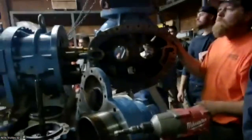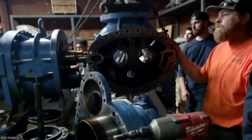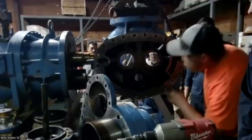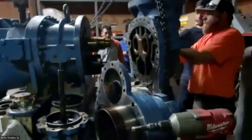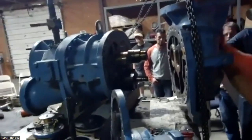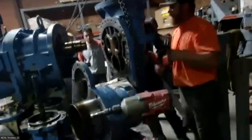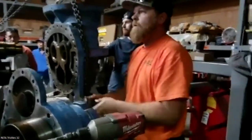Dustin, one of the warehouses had a machine with a problem with oil pressure. Can you describe that on this? So on that particular machine that Dan's referring to, you would turn the oil pump on with the machine off, and it would produce the required oil pressure, 45 PSI. But once the machine started, the oil pressure would drop out.